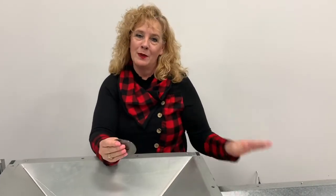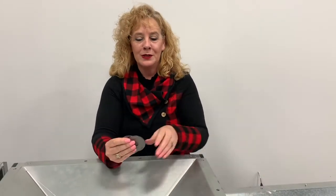Starting at the top of the machine we'll be looking into the flow control system. The flow control system for the rotary sorter is quite different than it is for the spiral separator. The rotary sorter uses orifice plates, and the inner dimension of the orifice plate is what determines the flow control system in the rotary sorter.